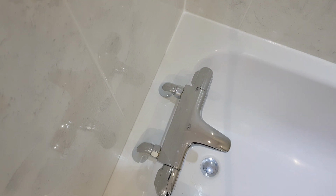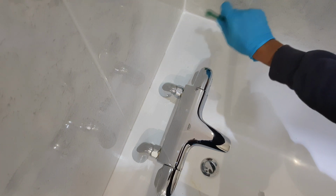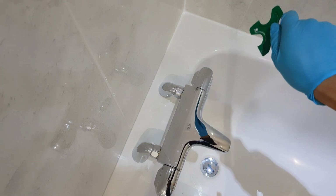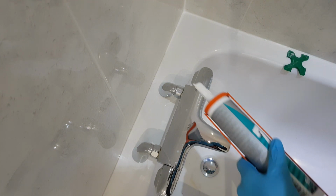One thing that I was able to do, and it's okay, I haven't finished it yet, is scrape off the excess using the side of the actual edge of the finishing tool. So you can scrape off any extra, reapply, take it up the various corners and just keep working it, each time progressively applying more pressure, because to start off with you don't want to be applying too much pressure because you want a bit of excess, and then you want to continue that on. Now I'm just going to finish up down the side, the back of the tap.